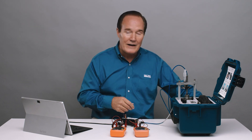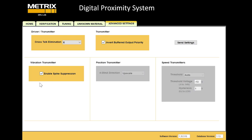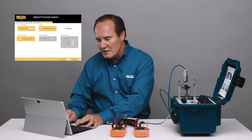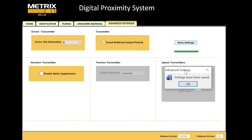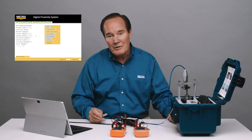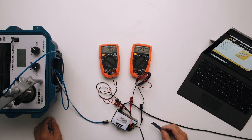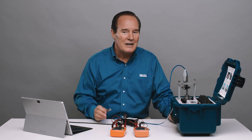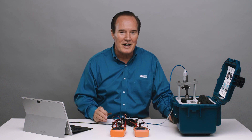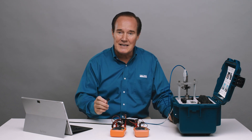If you're a customer who says you don't want spike suppression, you can go into the software under advanced settings and remove it. It tells you what spike suppression does, and then you send the settings. Settings have been saved — spike suppression is now off. Let's cause a spike again and see the effects. You can see the milliamps went way up, and that's something we don't want. Spike suppression helps you run your plant. It prevents false signals from getting into your control system that could cause your PLC or SCADA system to shut you down. Since we're sampling at such a high rate, we can tell if a signal is bad. If it's less than 25 milliseconds, it doesn't impact the signal. That's the key to spike suppression.